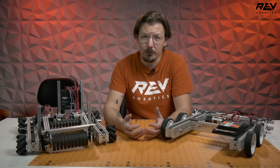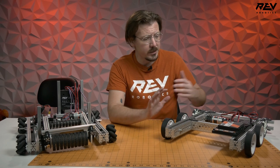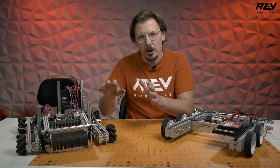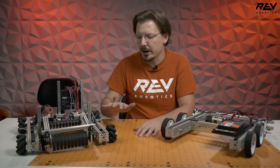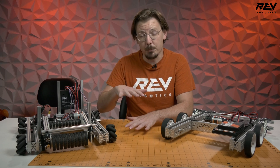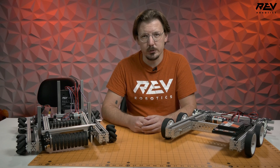One of the things we're going to take from here is doing a few minor adjustments to our channel drivetrain. We want to see if there's a way we're able to make it a little bit smaller and maybe get through the gap that's on the end — it's somewhere around 13 inches from what I remember, so that's going to be the goal with that robot. The second thing we're going to try is to see if we're able to modify one where we can get a little bit more ground clearance, so we'll likely throw some pillow blocks to get some wheels up off the ground and replace one of the sprockets we're running with gears to get that power transfer to those wheels.